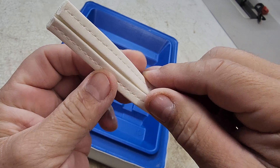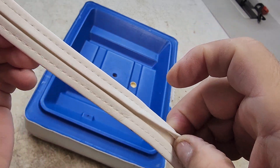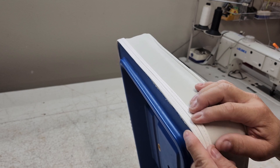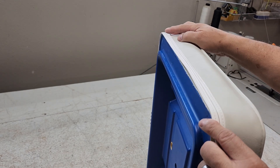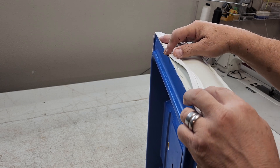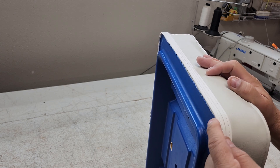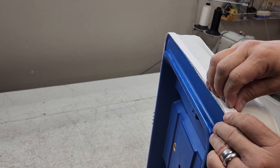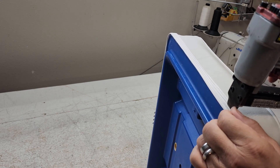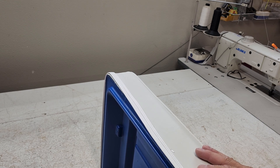Now this is what we call hide-em. Because when you put the staples down inside that little channel right there, it hides them - it hides the staples. So what I do is I go from one end, then I pull on it, stretch it, and go to the other end and set it there. The reason I do that is because if you started here and just started stapling down the line like this, it could start looking like the Dixie Highway. So what we do is just pull it straight, set it where you want it, and then put a staple. We'll set all the corners just like that, then we'll come back later and fill in the middle.